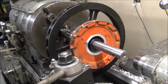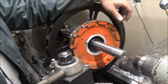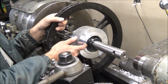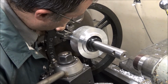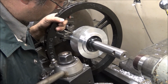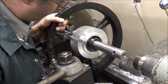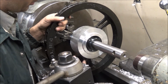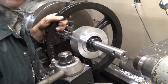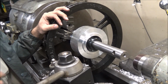Yeah, I like that. Let me get this off here and drill and tap 4 holes in this. I'll bore that out some more for clearance on that collar. Might go ahead and do that. So I won't be able to do that on here. But the center's not critical, it's just clearance. So I'll probably take it off and chuck this wheel and cut that out.